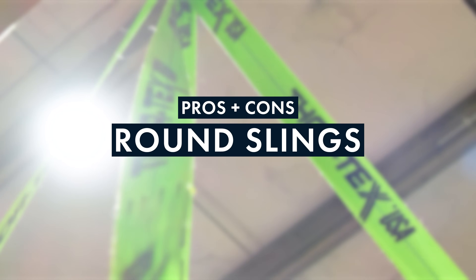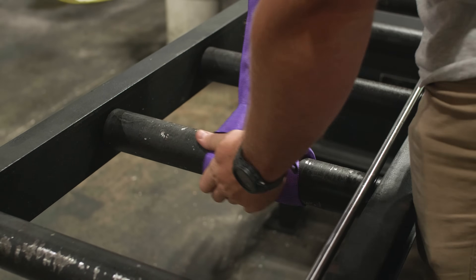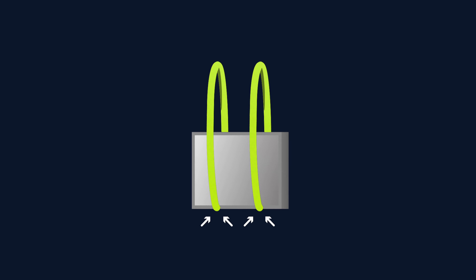So why would you select a round sling? Well, round slings are absolutely awesome in cases whenever you have a very specific lifting point — like if you need to lift something that has a shackle attached to it, or even a piece of machinery that has a designated lifting eye. For example, if you needed to lift a box that has a 90-degree corner and the sling needs to be underneath that box, a round sling is going to dig right into that corner and cause a crease point which might damage the box. So when it comes to specific attachment points, a round sling is going to be the way to go.